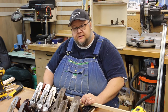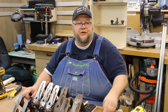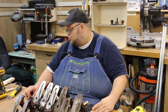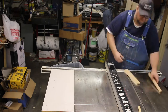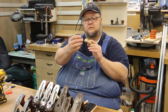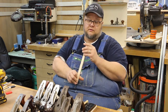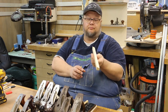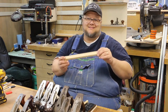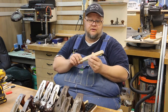That piece is going to need to have an angle cut on it, so that's what we need to do right now. We cut our boards - I did it at the table saw, but you could do it at a miter saw, put it in a vise, or use one of your hand planes. I did 68 degrees on my table saw, made this dimension a half inch, and then whatever the top worked out to be - about seven-eighths wide.